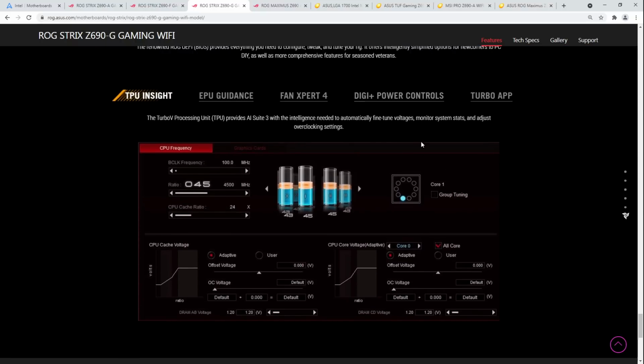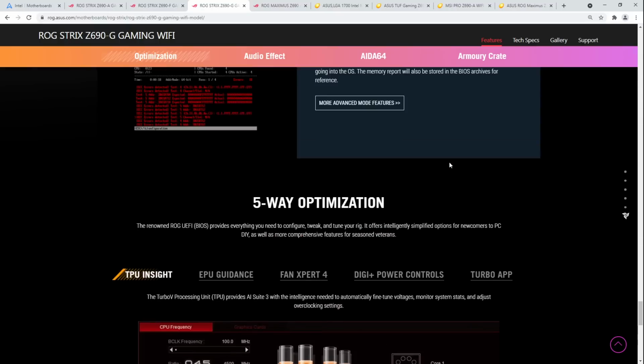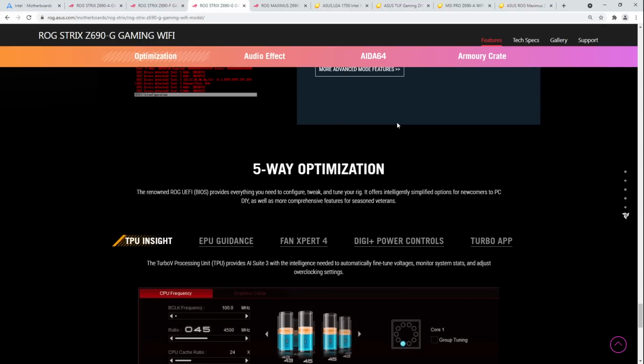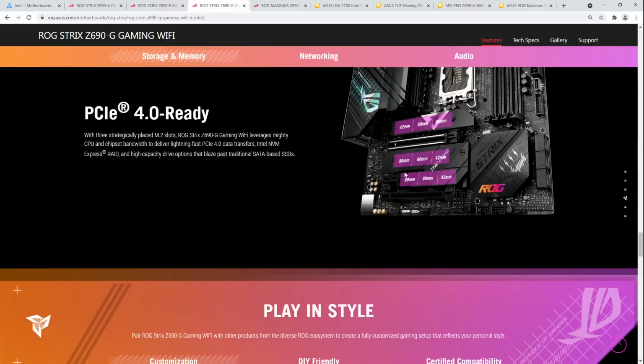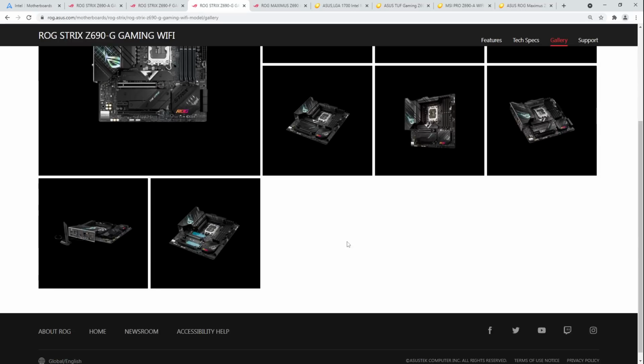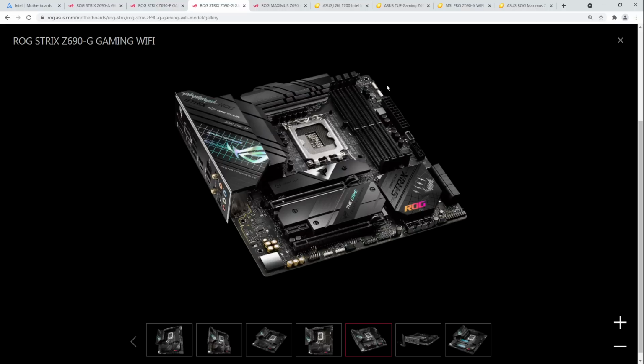So, yeah, that's the reason why I don't pay that much attention to layer count. Just because you've got more layers doesn't mean they're being used to add any extra benefits. But the thing is, this is the only high-end MATX motherboard there is. At least it's not terrible, other than the lack of a postcode, right? Decent number of USB ports, 2.5 gig LAN, Wi-Fi 6, clear CMOS, BIOS flashback. But I really wish it actually had a postcode. And then I'm also really suspicious about the memory speed. I am not sure what's going on with that.